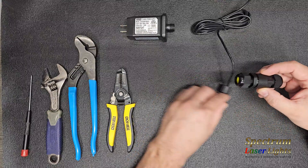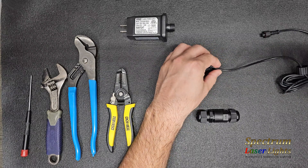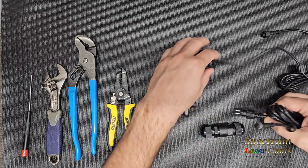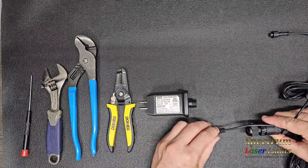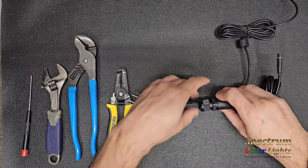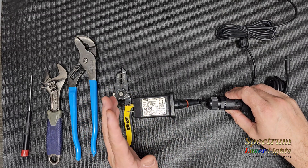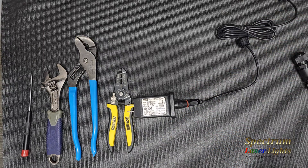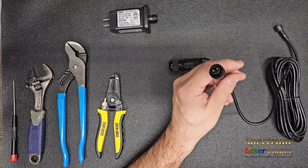We're going to use a cable here to demonstrate. This would represent cutting off a male plug that can't fit your adapter, in lieu of crimping on a B-tip or C-tip connector, so you can take your existing lighting fixture wire and accommodate a newer style adapter. It makes it completely waterproof for use outdoors or indoors — it's all low voltage and safe. If you make this as a raw splice, it's going to fail sooner rather than later.